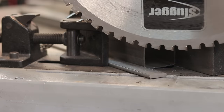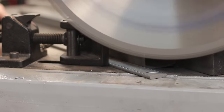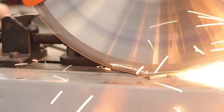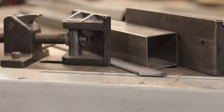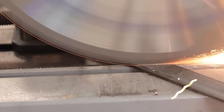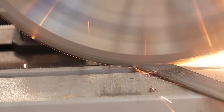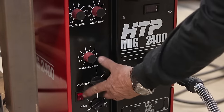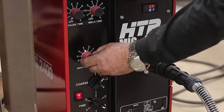It's time to get started on the frame itself. Inch and a quarter oh-six-three is the thickness I decided to go with — inch and a half looked too big, inch was too small, this seemed just right. This is a piece of one inch by three-sixteenths flat bar stock, and this is what I decided to use on the very top section of the metal frame. I thought this would make for a good separation between the wood part of the vanity and the metal frame — I'll show you what that looks like a little later on. Getting everything all cut out, and I'm putting this flat bar stock in there cutting it flat. I took everything nice and slow, then it was time to fire up the HTP 2400 and get the settings adjusted.